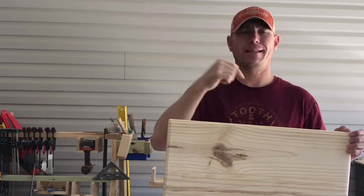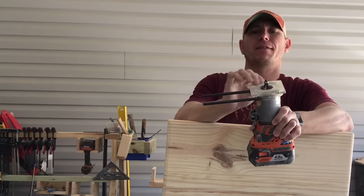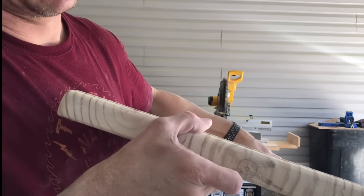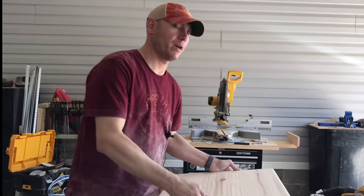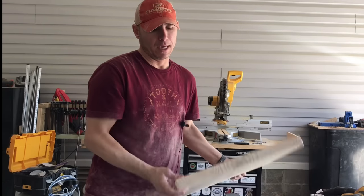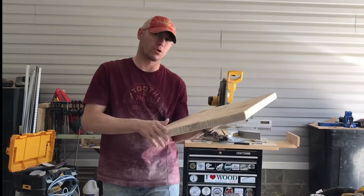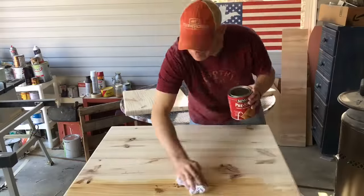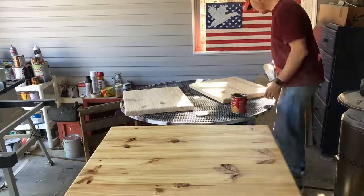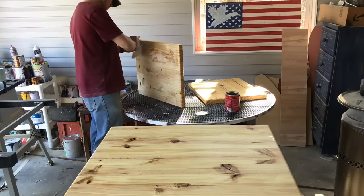One more thing — if you haven't seen my videos on how I do these edges: I use a 3/8-inch round-over bit and have it sticking past flush about a sixteenth of an inch, which gives you that little detailed edge. You could also just round it over fully or leave it square — though for square edges I'd knock that sharp edge off with the orbital sander. On the bottom I took a quarter-inch round-over bit and rounded the bottom edge so it's smooth. On the corners I rounded those off too. I always like to use Minwax pre-stain conditioner on pine — apply a liberal amount and wipe it, then let it dry for about 30 minutes before putting any stain on.